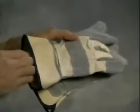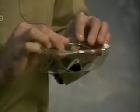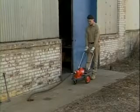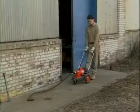Wear leather gloves only. Never use any other type of glove, such as cloth, rubber, or coated gloves. Never touch the cable while it's rotating. Wear safety glasses or goggles to protect your eyes from any debris thrown from the rotating cable or drain opening. Operating the Model 88 is a one-person job. Never have someone else operate the pedal. This can result in serious injury.